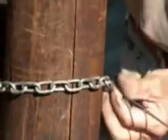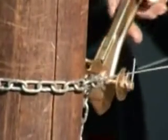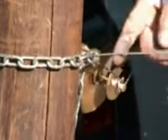Hold the Cortool correctly, with the head facing upwards, and turn the disc's specially cut notch to appear level with the handle. The binding wire is then inserted into any one hole on either side of the Cortool head, and is locked at the notch. The loose chain allows you to move the binding side up and down according to your binding and fencing needs.